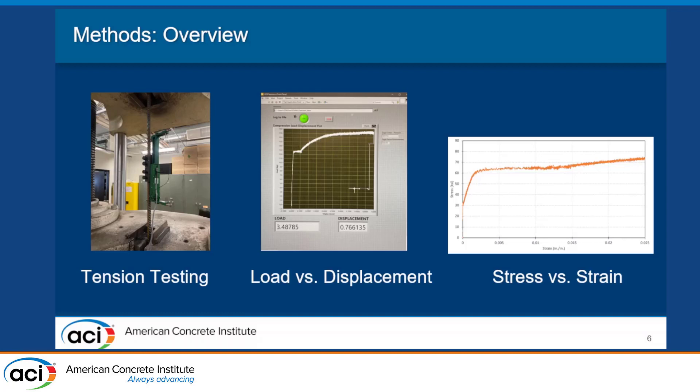There are currently no ASTM testing standards for mechanical couplers that we could find, so we followed the guidance of two ASTM standards: the first for steel reinforcing bars, and also for the tensile properties of FRP composite bars. We used a Tinius Olsen 400K Super L tensile testing machine at Northern Arizona University along with an Epsilon rugged strain gauge extensometer. From these two pieces of equipment, we collected load and displacement data, which we then converted to stress and strain — dividing displacement by gauge length and load by the cross-sectional area: 0.2 square inches for the steel bar and approximately 0.23 square inches for the GFRP bar.